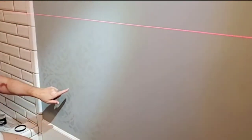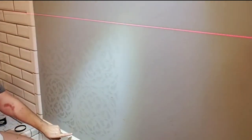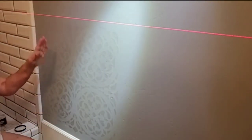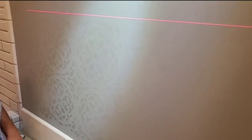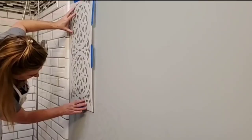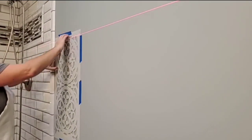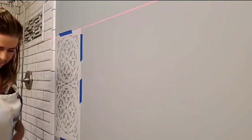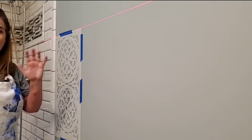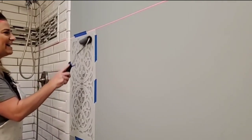When you see the final pictures you'll really see how apparent the contrast is in person. The one thing you want to be very careful of with this technique is stencil placement. Take extra time between each placement to make sure you've got it right — the actual application is easy, it's the placement that takes the most time. I used a laser level and moved it with each placement, running it all the way across the wall so I always knew my stencil was level.